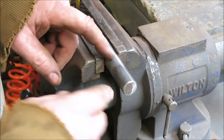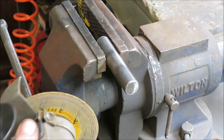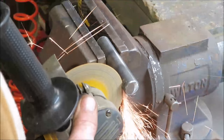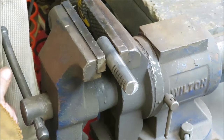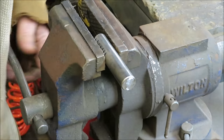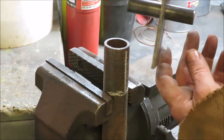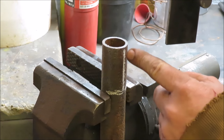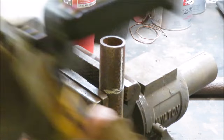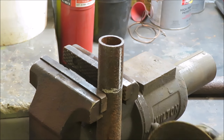I took that piece of metal back out of the hole and I'm going to put some little grooves in here just so it won't slip off the two-by-four. I'll take my angle grinder with the cutoff wheel and make some grooves on both sides. How I'm going to fit the handle on there is I made a cut down through the pipe on both sides so the flat piece fits inside of it — using just the four-inch grinder. Most of this work, almost everything I've done so far, can be done with just a four-inch grinder and a drill. If you can do that, you can make this tool.